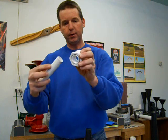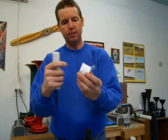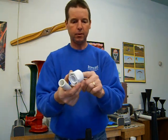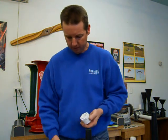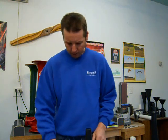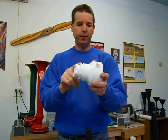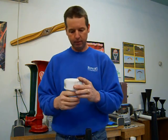The main reason is because we want our pipe that's going to slide all the way through this to have a nice snug fit on that inner bore that's factory made. So you're just going to be getting rid of that ring, leave the bore alone, don't mess with it at all. Nice tight fit for airtight. The one that you reamed out is going to get glued into the front of that, and that's pretty much all our parts on that end of it.